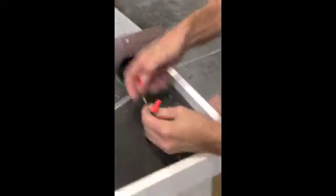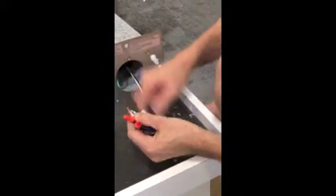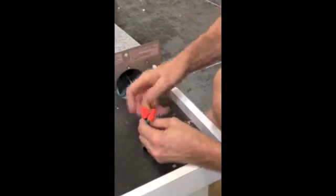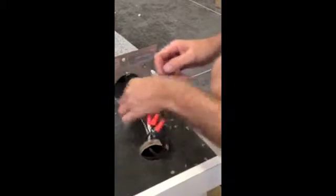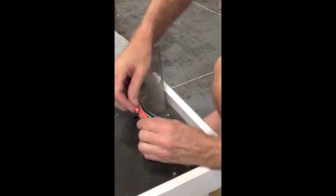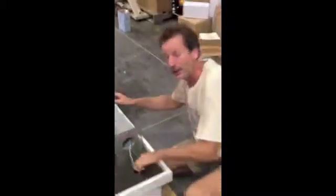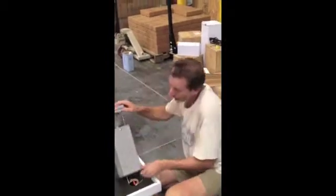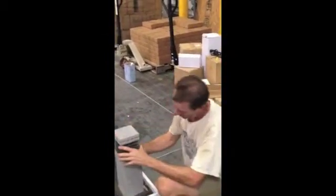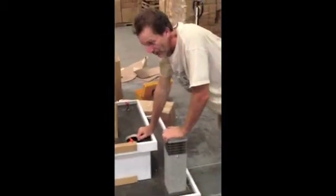Connect the blacks with the black. The white with the whites, the greens with the greens. And then at this stage, you can check to make sure the fixture works. All the fixtures were tested prior to shipping. Unfortunately, to ensure that they would ship safely, they were removed and put back in their packaging, which will make a little extra effort for you. And then if you choose, you may fasten the fixture down to the level with a screw. The troughs will be filled with glass beads once all the units are tested.